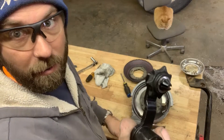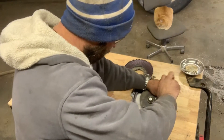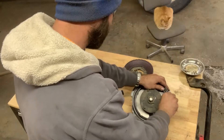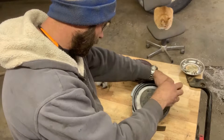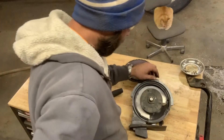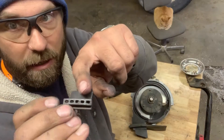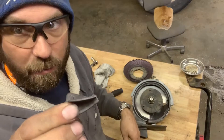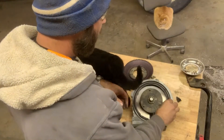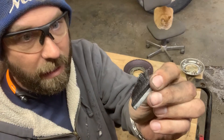Here's a new one. I don't know how much these are — you get parts, you just don't ask, you don't want to know. There's a little screw you take out here. The kit comes with new screws — this screw definitely has graphite or something in it. That screw holds in this little flapper, which helps the beans come along and push the beans down against the radial bean meter. And we've got this brush right here, which is the first part to help brush the beans off of it and make sure you only get singles.